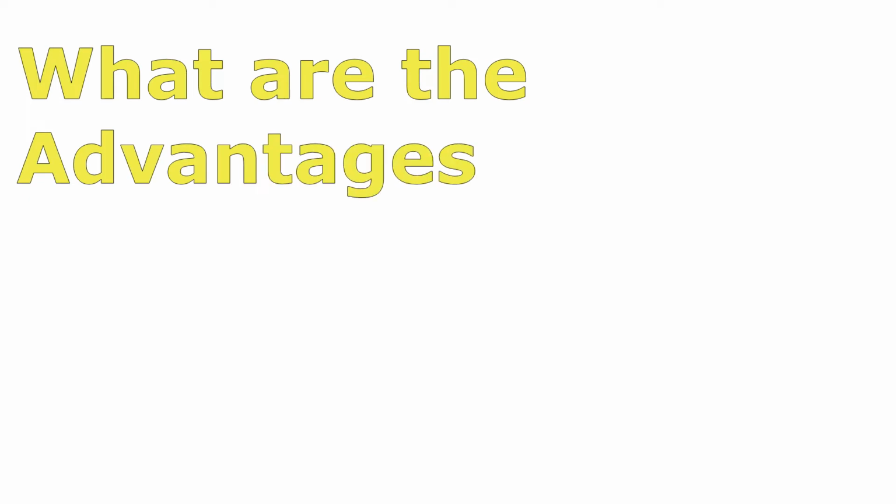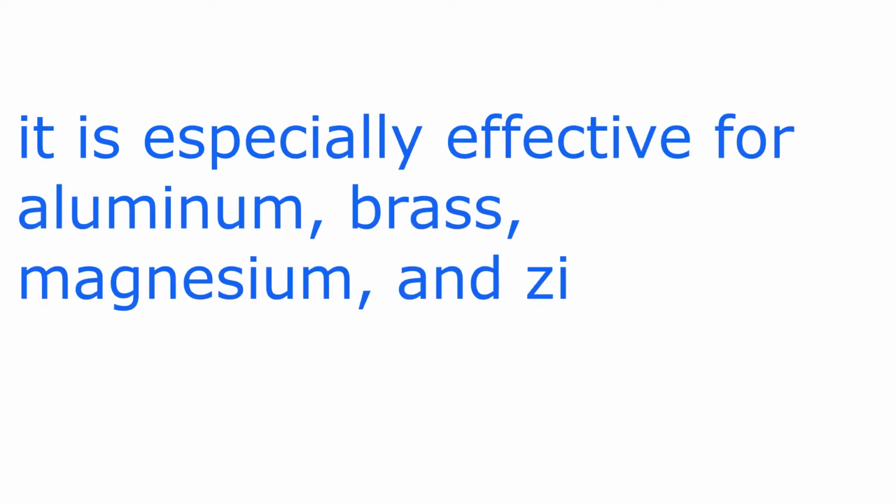What are the advantages of wet blasting services? As a whole, wet blasting services promote longer media life and create a softer and smoother finish. Wet blasting can handle many surfaces, however, it is especially effective for aluminum, brass, magnesium, and zinc surfaces. Here are some other benefits of wet blasting services to consider.